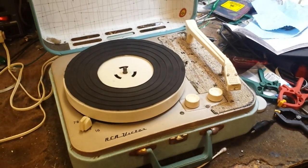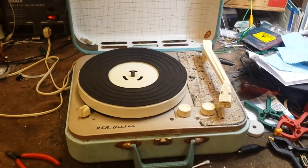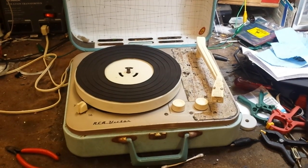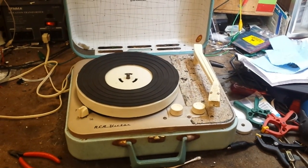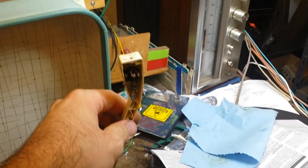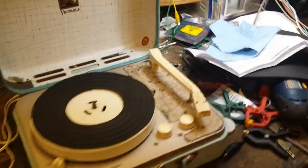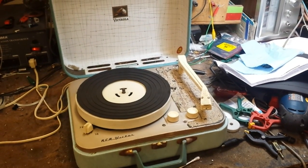There's really nothing more to it than just a separate regulated supply. I fed the primary of the 18 volt transformer with one side tied directly to the interlock plug and the other side to the low side of the power switch, so it turns on with everything else and isn't running all the time. I also had to change the loading resistor — originally it was around 150k, and I stepped it down to 47k to load the preamp down, otherwise some frequencies were kind of distorted. So 47k shunting the input to the preamp made it sound really good. Thanks for watching — more unique and interesting stuff to come soon.